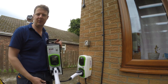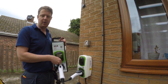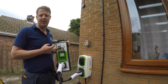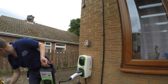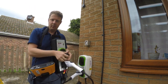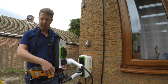We need to perform some electrical tests as well. The handy thing about this EV ChargeTech unit is that on the front there's a 13 amp socket outlet, which you can then plug your normal multi-function tester into and do your earth loop impedance test and your RCD tests. Simply take your multi-function tester, plug into the EV ChargeTech unit, and now I'm going to do an earth loop impedance test.